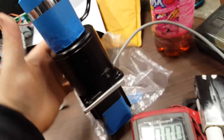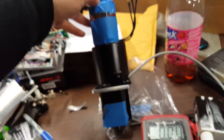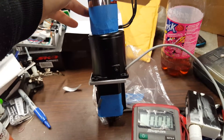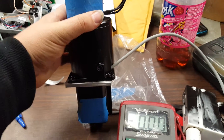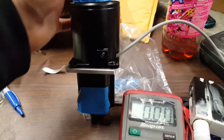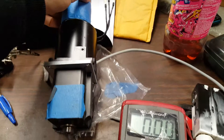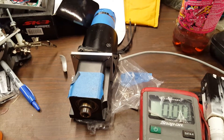This is a 2800 watt outrunner brushless motor. This whole setup, even though it looks really tall, is actually the same height as the old motor with the pulleys, and it weighs a good amount less — this case probably weighs about as much as the spindle pulley alone, so it's really a lot less weight overall. But yeah, that's pretty much the gist of it — I wasted enough of your time. Most people only watch about a minute because I'm boring but informative.